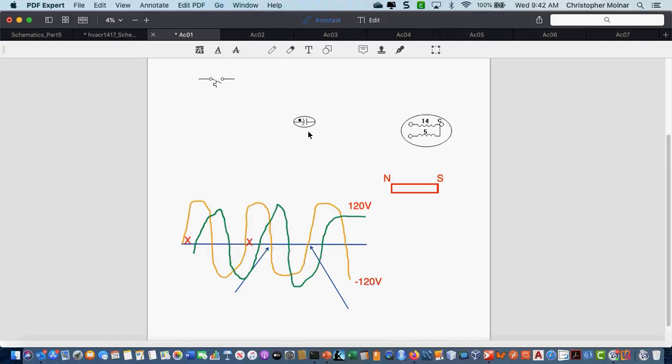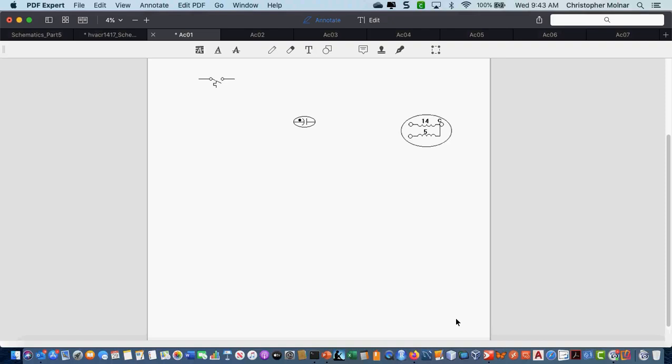Are there any other names for them? What, this type of drawing? Yeah. I've always heard them referred to as a pictorial or as a wiring diagram. Why, did you hear something else someplace? No, I'm just trying to do my own research on drawing ladder schematics, and it seems like there's a varying array of ways that people do it. They don't all look the same. No, they don't, unfortunately. A lot of people these days are crossing wiring diagrams and ladder schematics together as a hybrid sort of thing. A lot of companies are basically trying to save ink on some of their diagrams, and it's become a real big issue. So we have to work with the base that we have and just go from there.